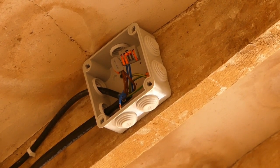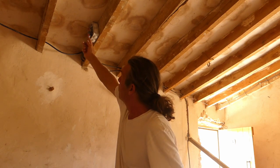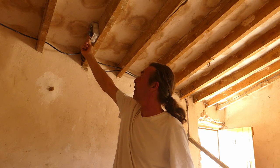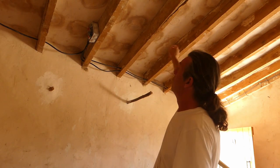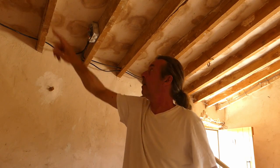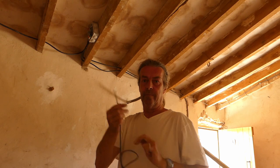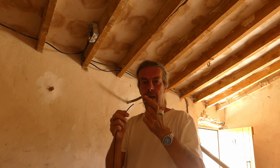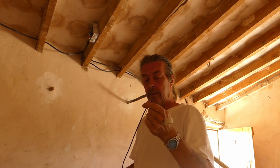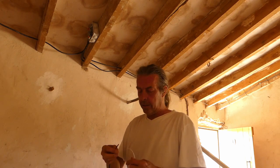So I need to get the lights bit sorted out now. The bulb holders come pre-wired. What I need to do is get a wire from my blue — which is going to be my positive, it gets confusing I know — to run to that light which is here. So I need to drill through both of these two and through this one as well to get to the other light. So I need four pieces of wire: two to go to this light here with a bit extra, and two to go to that light there. I just have a single wired cable here, I'll cut them out of that and then connect them together. The black then will go into there and the other one will come back and run into the neutral.